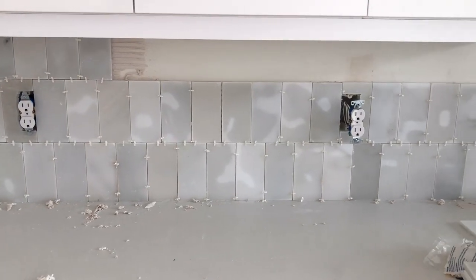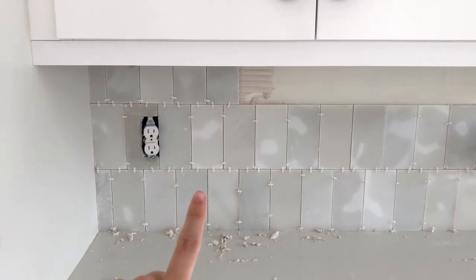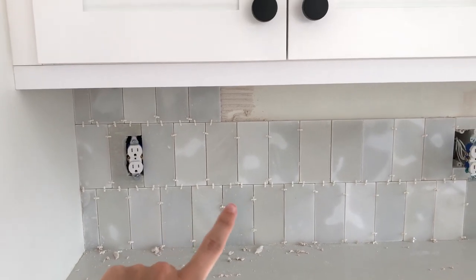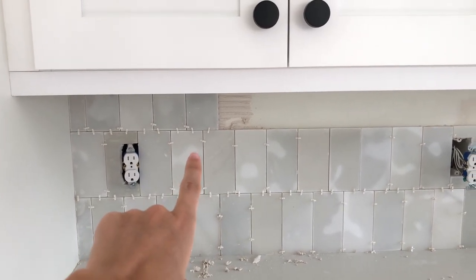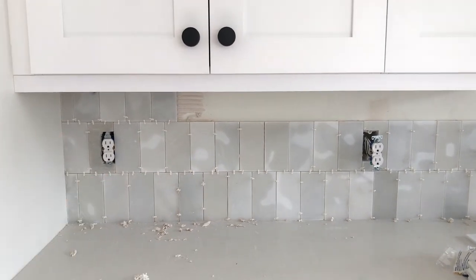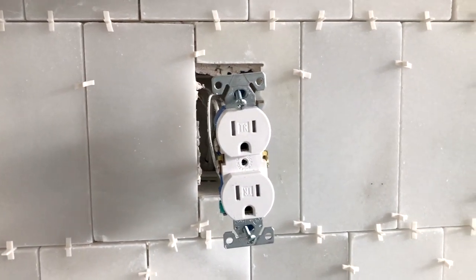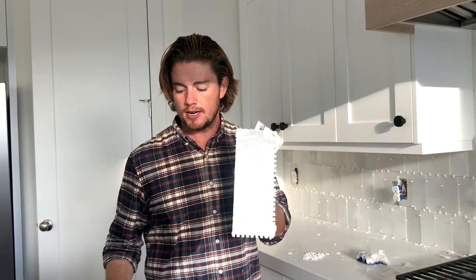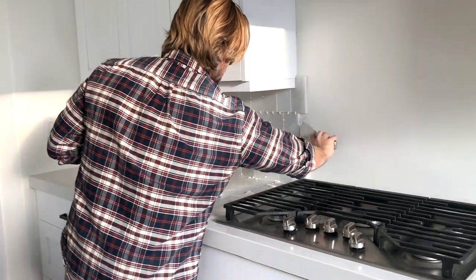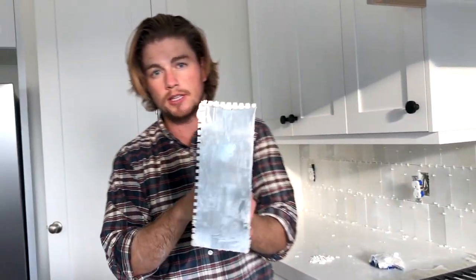Here's what it's looking like right now. What's happening with all these splotches is the tile is very absorbent, so it's absorbing the moisture from the mortar behind it and actually making the tiles go a lot darker because they're wet right now. This light color here is more accurate to what the final coloring will be, and obviously these splotches will all go away once it dries. These spacers are what's keeping everything kind of even. I found it better to work with a smaller knife rather than the big trowel — I'm getting the spots specific that I want and I score it with the tile trowel.